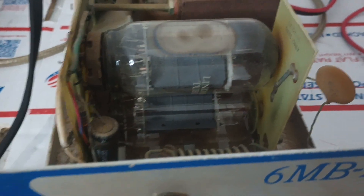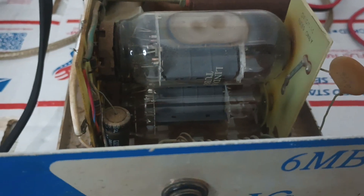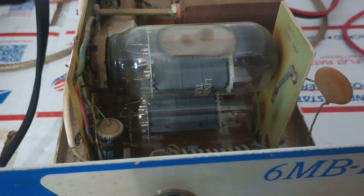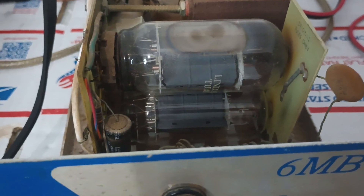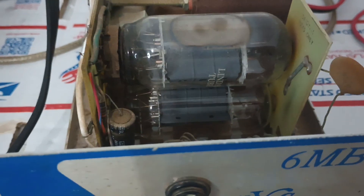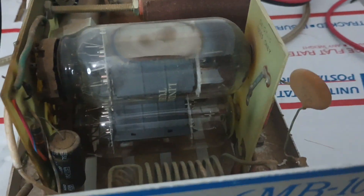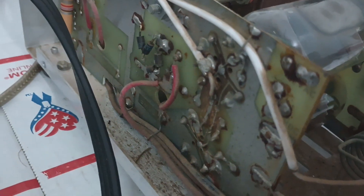Generally when you've got a real weak tube, they'll rise up in power a lot — considerably — when you stay keyed down. Now we did see the dead key come up. That doesn't worry me too much on these tube amps. A lot of times you'll see that when you stay on the key for four or five seconds, they'll come up a little bit. But it could need tubes put in it. Unfortunately, I can't tell exactly what kind of tube it takes, and some tube guru out there may be able to tell you about the pin out and everything.